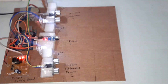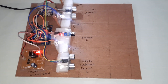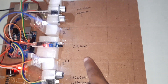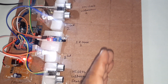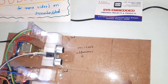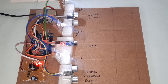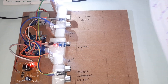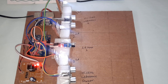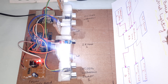We can extend to three ultrasonic sensors depending on the requirement. The setup includes a power supply board, Arduino Uno R3, ultrasonic sensor 1, IR sensor for detecting nearby bicycles or pedestrians, and ultrasonic sensor 2. We control brightness through PWM for energy efficiency — if no vehicle is detected the light uses 1 volt, and with vehicles it uses 5 volts, saving 4 volts.